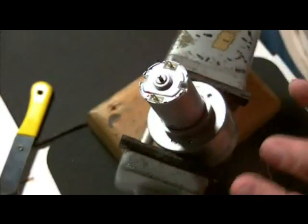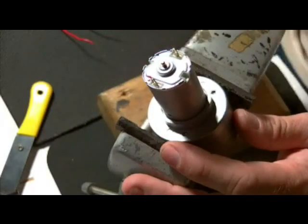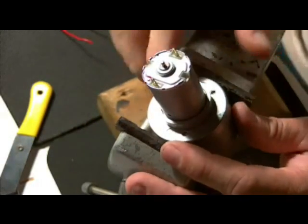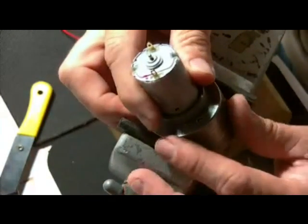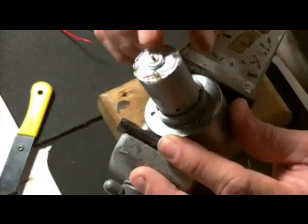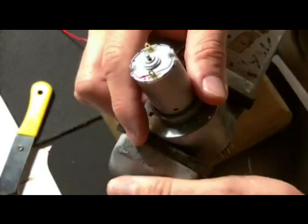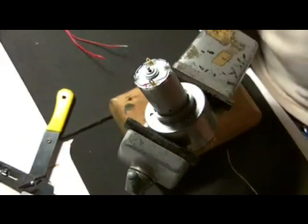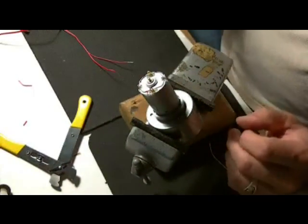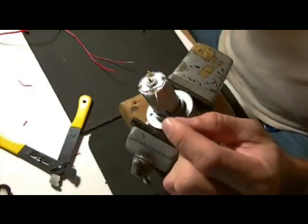And for your motor — this is the only holder I could have, I hope this is clear enough for you. Turn the wire down just a little bit. You can see on the motor that you will have untinned connectors — these are just your copper connectors. You want to tin them as well. The tricky thing here is you don't want to fill up the holes.